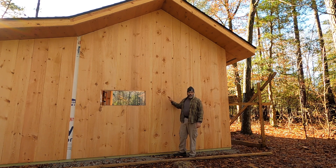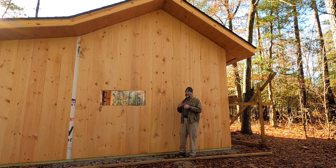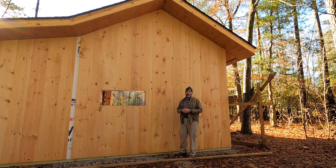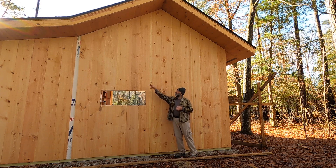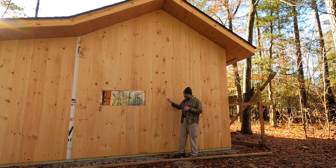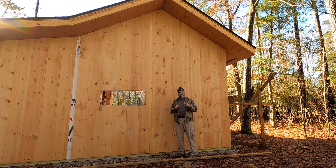One thing I wanted to point out with board and batten siding: you have to be careful with your styling if you care about that kind of thing. Board and batten gives you basically vertical leg stripes that accentuate the vertical height of a building, and depending on other features in your walls, it could look really bad on a really long tall wall. On the back here there's nothing to interrupt it and no one's really going to look back here, so I ran 16-foot boards from the ground all the way up to the peak. I transitioned to 12s closer to the end of the major peak, but the battens will also be 16 foot — so this is going to be a very long board and batten wall.